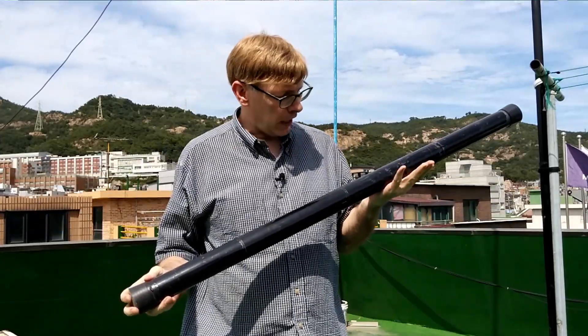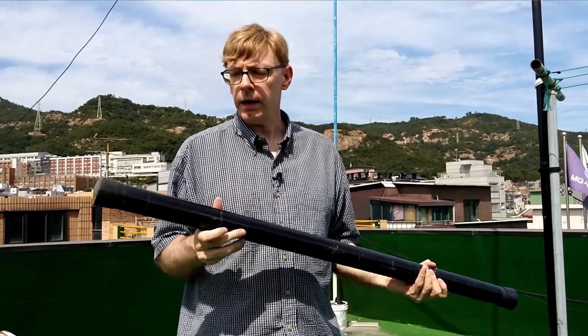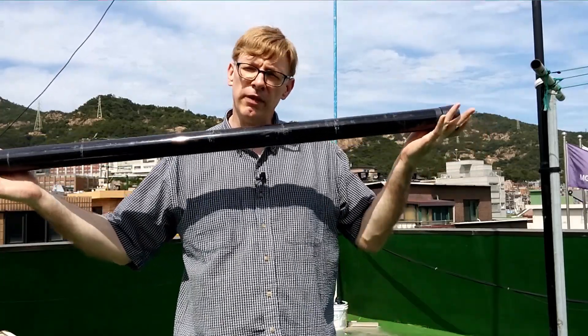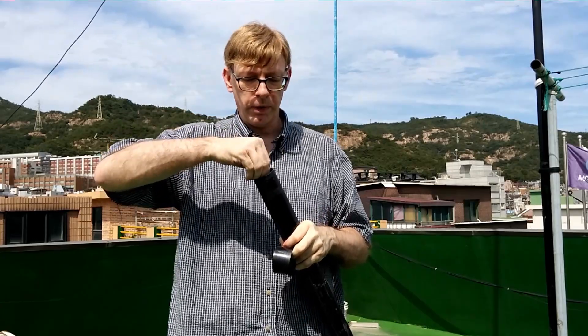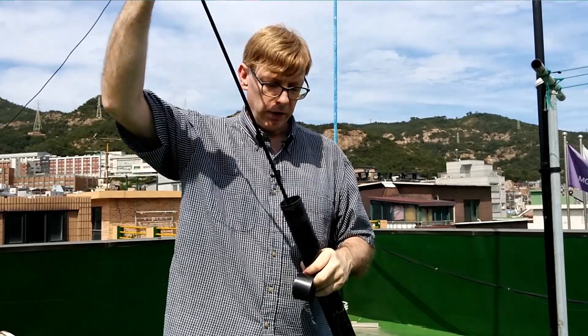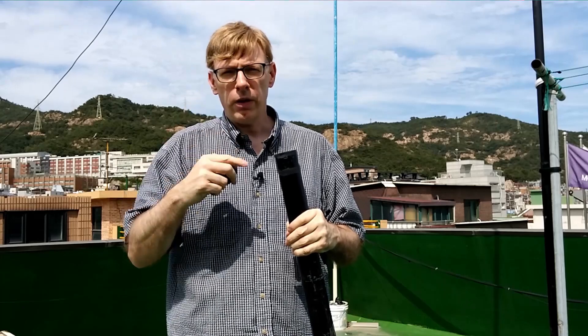By the way, I thought I'd show you the length of one of these collapsed spider beam poles. You can get them on spiderbeam.com. It collapses to a pretty good size; weight is about 7.7 pounds or so. The top and bottom actually come off — you pull the rubber piece off the top, then pull out the center, and from then on it just becomes a thicker and thicker section. You pull them to lock them tight. They do sell clamps, but I've gotten by fine without them. I usually just twist them and sometimes tape them with electrical tape. If you leave them up for a day, as the pole gets colder or warmer it will expand and contract and can come down, so you want to tape them at least if you plan on keeping them up for a time.